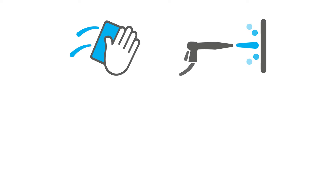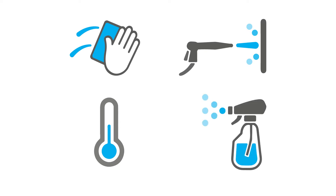There are three valuable tools when building an allergen cleaning regime. One: mechanical energy — for example, scrubbing product, water turbulence, and high-pressure water jets. Two: thermal energy — for example, warm water or hot CIP washers. And three: chemical energy — the action of cleaning chemicals or detergents on the food soil.